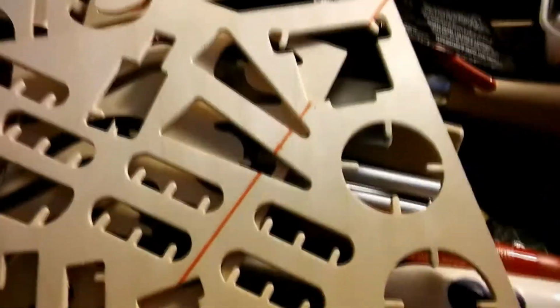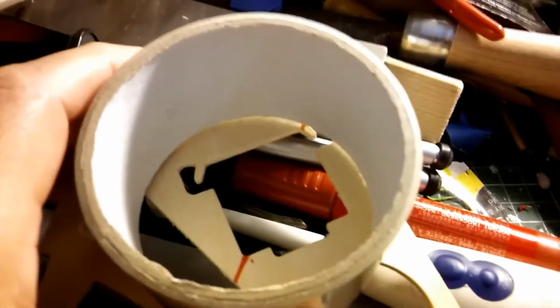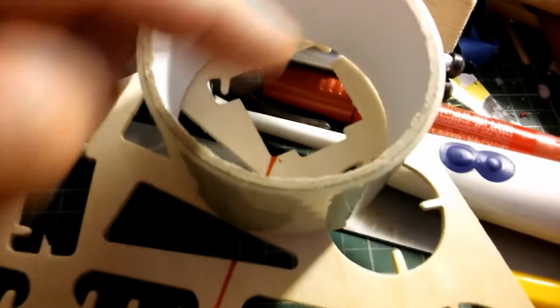Now, if I glue some more bits of wood up at right angles along those edges, any circular item that we place in there and push up against the corner, that red line will indicate the centre. So you do it one way and then you turn it and do it again, and you'll have two lines or two marks showing you where the centre should be.